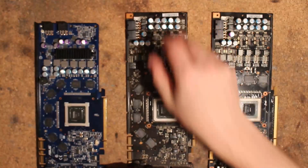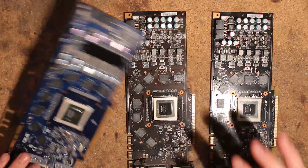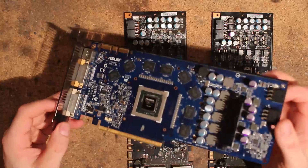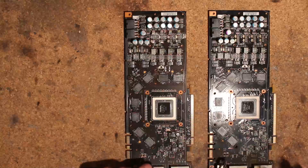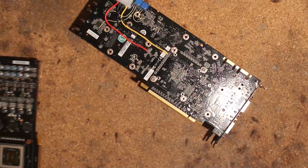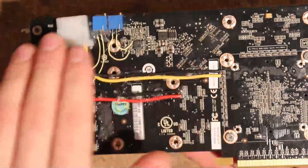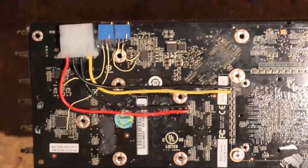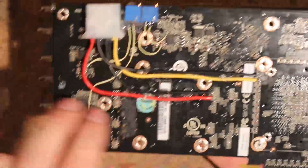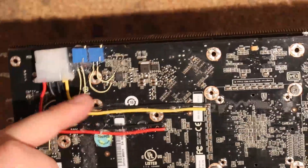I would expect the Samsung cards to be doing slightly better, but this might just be this one here not being the greatest sample. So take that with a grain of salt — I have one Hynix card and this is the Samsung card. This one is actually modded and these two are 65 nanometer reference PCBs; this one is a 55 nanometer reference PCB. It currently has the Morpheus air cooler on it. I'll throw the single stage on here soon. Volt mods on here are pretty basic — just feedback mods for vGPU and vMEM.